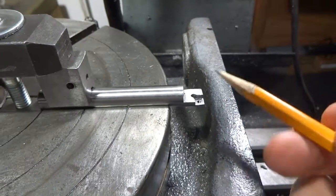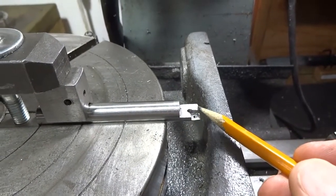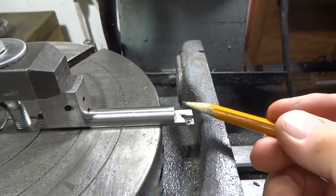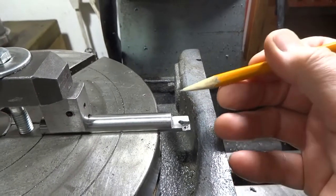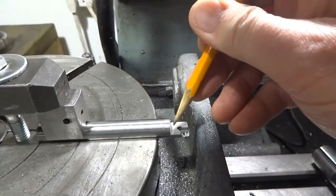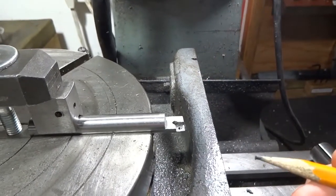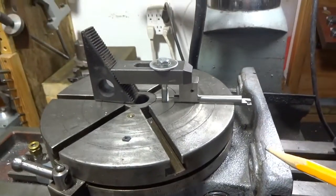First I created this flat, which is set back about a half inch and is right on the centerline of the material. I came down with a cutter and took off 250 thousandths off my half-inch bar.